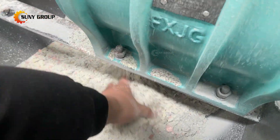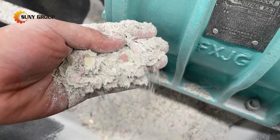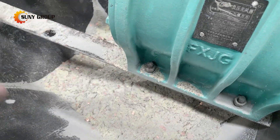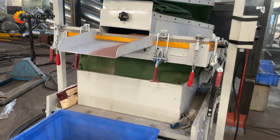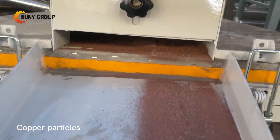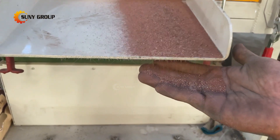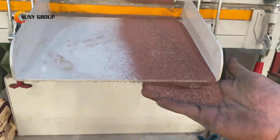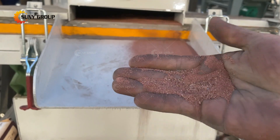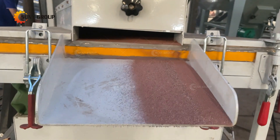Step 2: Grinding. After pre-shredding and crushing, it is essential to grind these tiny particles into powder by utilizing special grinding machines to make them easy to separate. Step 3: Sieving stage. The sieving stage, which features a vibrating screen, involves sending the small pieces without grinding them back to the grinding mill for further grind process. The produced powder will follow its process by continuing to the next stage.